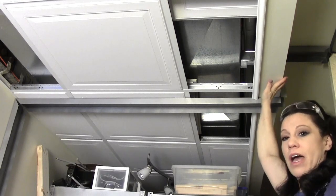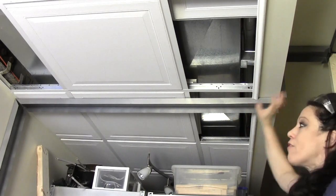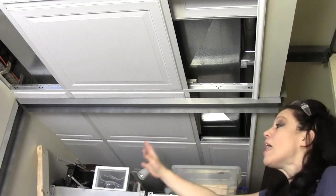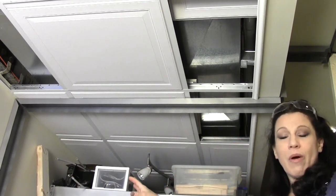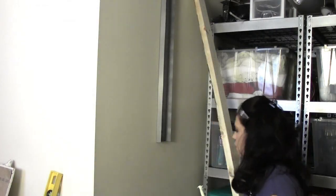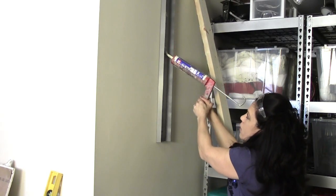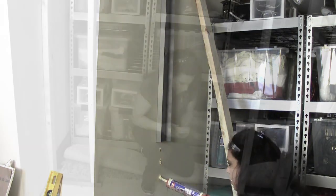The next channel goes in the same way as the last wall. You can cut out all your angles or just cut a slit and conform around any ceiling configuration. The only problem is there's no 2x4 behind this long length on the end, so I've left it in one piece and glued it in place. Once it dries I'll put a 2x4 in the channel and glue that in as well. I've drawn a plumb line and I'm applying construction adhesive — this one dries quickly, has low fumes, and holds really well — in small beads all the way down the area.